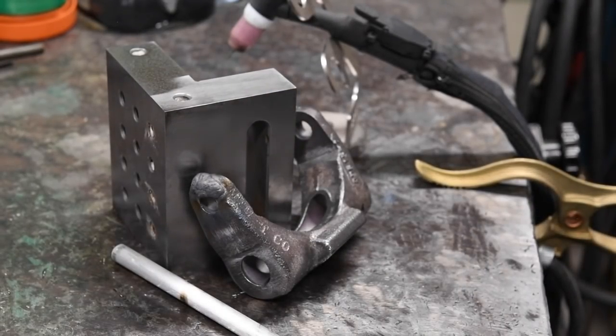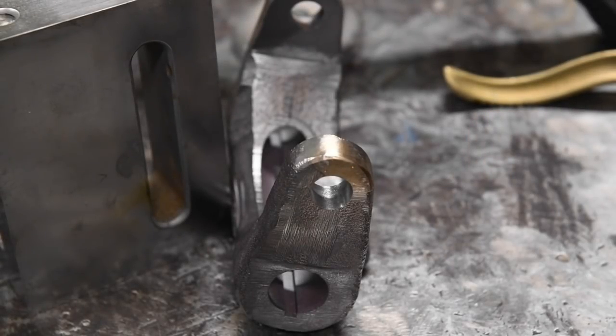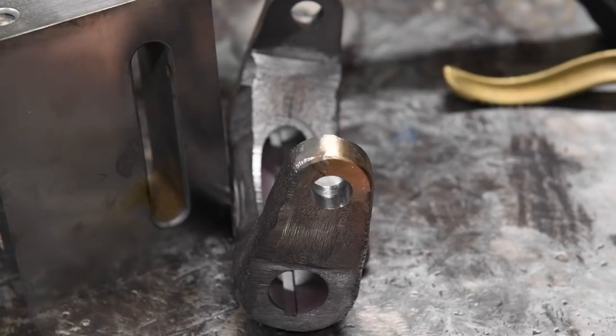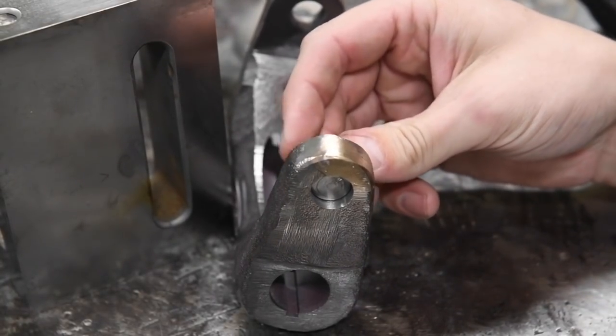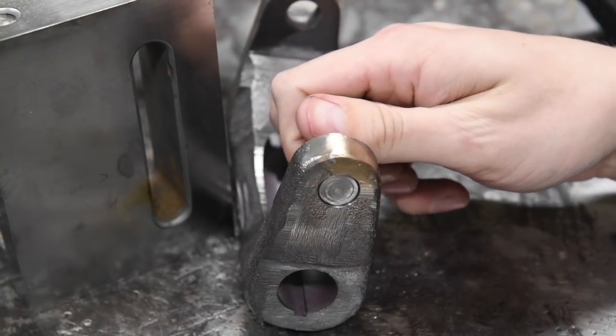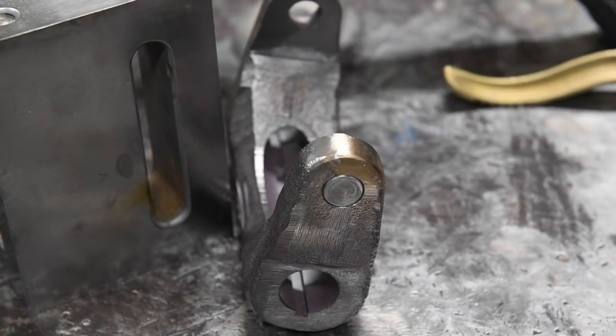Should be all right. I think that'll be a suitable repair. Had a couple of spots where I melted the cast iron and it flowed in with the silicon bronze, which isn't good, but it does happen sometimes. And then I just took a burr and then my little flapper thing to clean up the inside. Yeah, I think that'll be just fine.